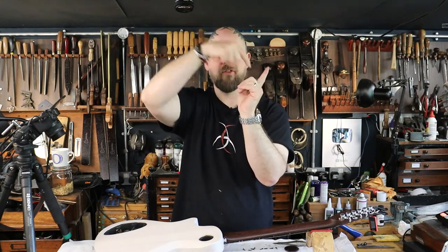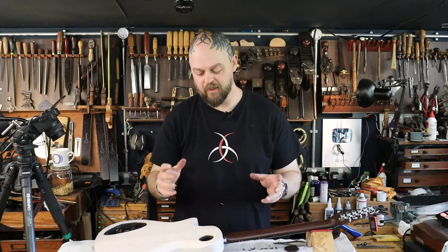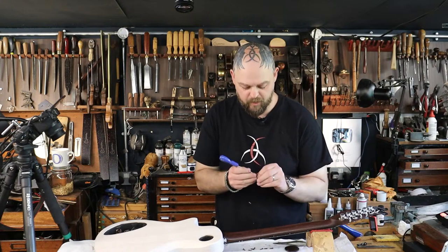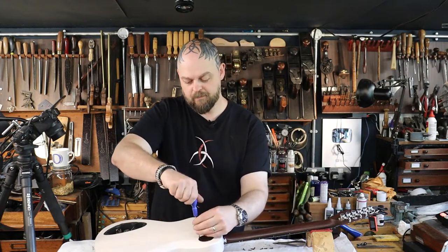When it was soldered together, your three-way toggle, you got the two things in the center to which you wire your out, and then you got a pickup going to one side and a pickup going to the other side. The pickup wire on the one side had been soldered through the eye hole of the piece, and that had been moved ever so slightly, and the end of the wire was grounding out on the outside of the switch, and that's what the problem was. So, well, there we go. What can I say? Fixed.